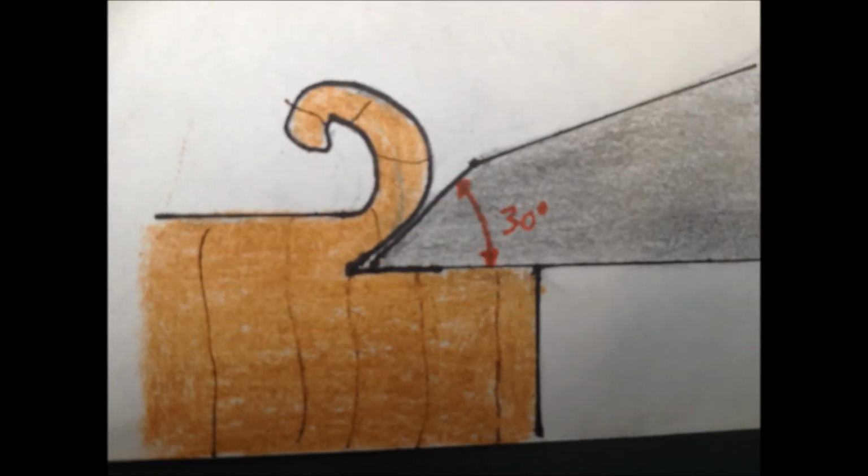With the sharpening angle at 30 degrees, it produces a sharp edge on the chisel, allowing it to cut through the fibers of the wood, creating a nice smooth finish when the chisel is used correctly. This will be discussed in more detail in the next video. As you can see in the diagram, the 30 degrees begins to curl up the material, removing it easily when providing enough force.